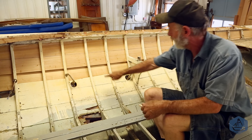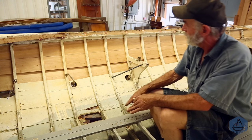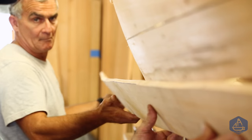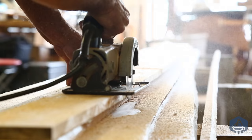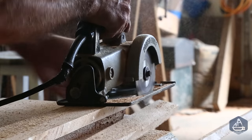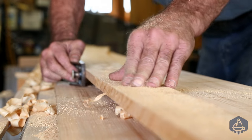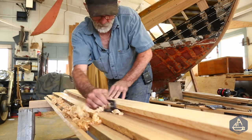I'm going to cut this plank on the top edge, then remove the plank it's lapped up onto, and once it's fit to that top edge, transfer the line-off lines onto the bottom edge and cut that. Now the plank is removed from the boat and set on the bench with a spacer underneath so we can saw it without cutting into the bench. We sawed very close to the line but haven't taken the line away. Next, we pick up a plane, lay it on its side on the bench, and plane that top edge right to the line at 90 degrees, splitting the pencil line right down the middle.